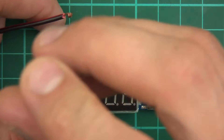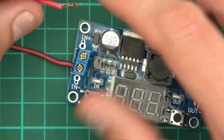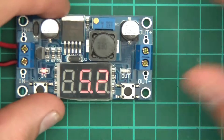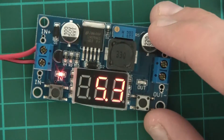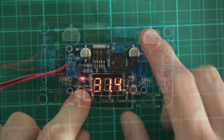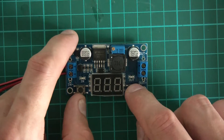Of course I'm going to have to wire up the DC power supply, so I'll do that first — let's screw these terminals in. I always have problems with these. It's in nice and tight. I always seem to overexpose in these videos so I'll just turn these lights off. Hopefully you can see — it says 5.3 volts, so that's the input voltage. I'm going to push this right up as much as my power supply will go. I press the IN button and it reads 31.4 volts.